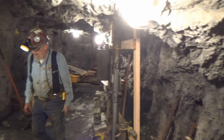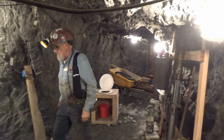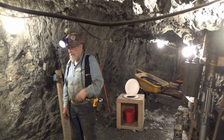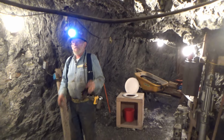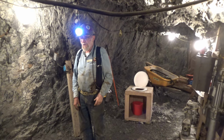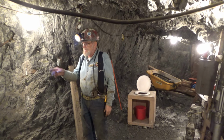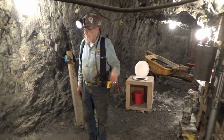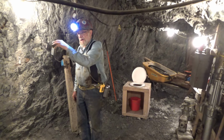We'll come out where that silver vein is and drill and blast straight up into that silver vein about 8 feet in diameter, and we'll put chutes in there to get the rock out and a man way to climb up and down. And we'll do this till they get about 20 feet above the track, and then we start mining that silver ore. That's where we use that jackleg, that machine that they were learning to use there. There's one of them right there. And we'll drill and blast in that silver ore and scrape that ore into the chute.